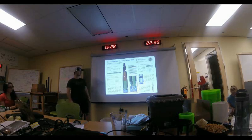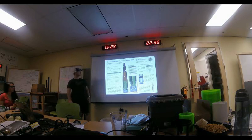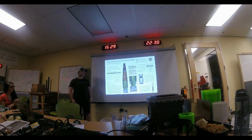The next requirement was supporting the dry mass of the rocket. All of our parachute deployment testing has been done, with some further testing still needed to verify the parachute anchors. We measured about 68 kilograms as the maximum load in our worst-case scenario for parachute deployment. As for weight, our target was five kilograms — we ended up at 6.4 kilograms, a little heavier, but there's a lot of room for improvement through skeletonizing what we have.